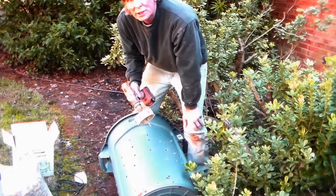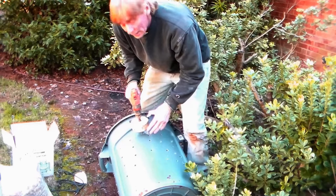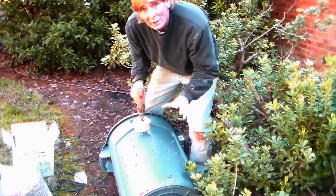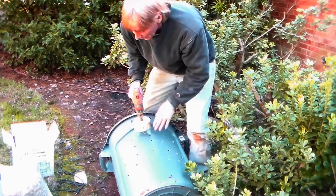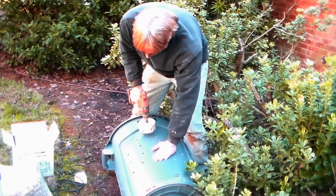One other thing we're going to do is drill a four-inch hole right in the side of the pit. That's for the footer tile to be added in the future, because I know this crawl space is going to need footer tile. Right now the homeowner just wants the sump pump and a discharge installed, but this will be able to attach to the gravel perforated four-inch pipe. Let's go ahead and drill this hole.